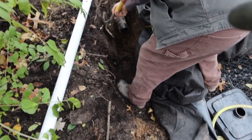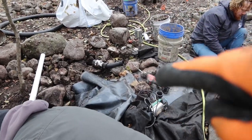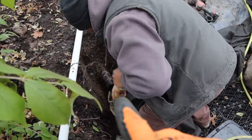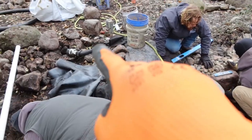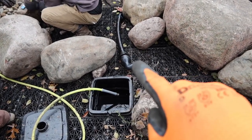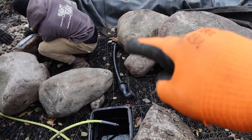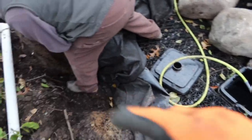Louise is digging out around the three-inch where it connected to the two-inch going into the old centipede and snorkel. We're going to put a three-inch coupler on that, bring that three-inch line up, over, and down, and reconnect it with another coupler so we can tie it back into the old check valve. We're reusing all that plumbing — cut the two-inch flex, put a couple couplers in it, add some two-inch rigid to get the depth to the bottom of the pondless vault to hook up the pump.